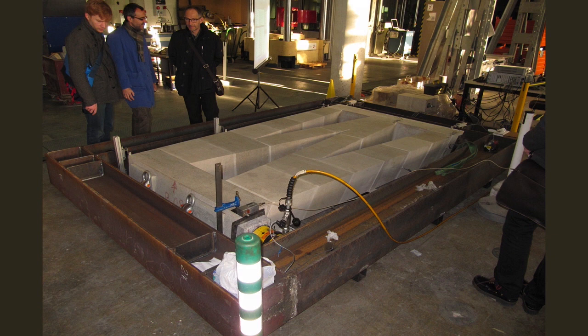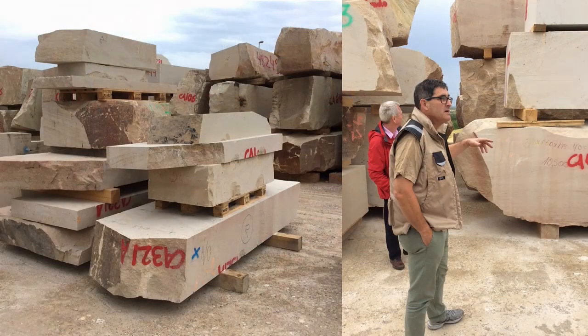It's quite odd that using old-fashioned techniques of stone and cutting it to size is faster than the modern technique of using concrete. Then the question is: it's a natural material — does it behave the way we've predicted? Is our simulation accurate? So we load the proof of concept model and check that it behaves as expected, particularly under those extreme stresses, and luckily it does. And then we face reality: Sagrada had bought all these stone blocks when they thought they were using them to face concrete, and now we're using them structurally. Has all the stockpiled stone got the strength to do the job? Luckily the answer is yes too.